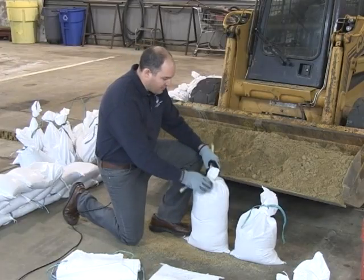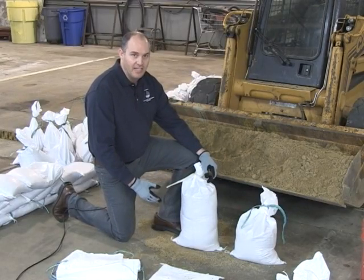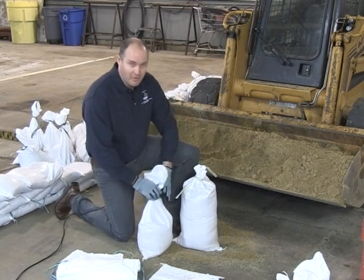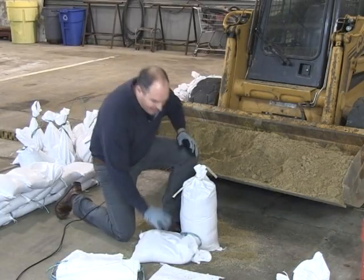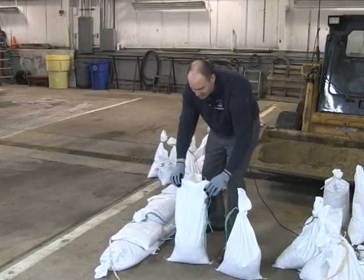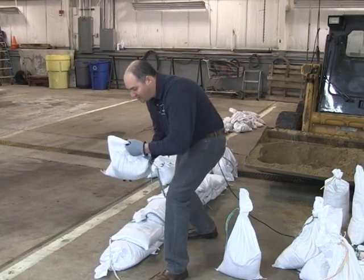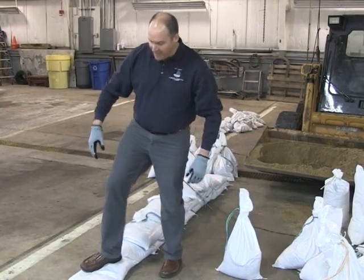This here is an overfilled bag — you don't want to overfill it. First, it's very heavy, and with volunteers of varying ages helping out, moving sandbags this way will wear people out. This here is about a half-filled sandbag; this is the proper capacity. It's easy to manage and also better to place because when you lay it on the ground you can pack it down. When placing the sandbag, fold over the flap but leave some room so the sand can move around, then drop it into place using the weight of the sand to compact it, and use your foot to tamp it down.